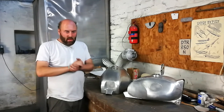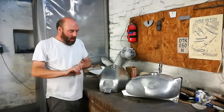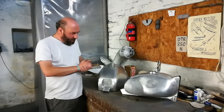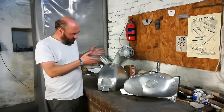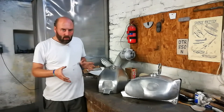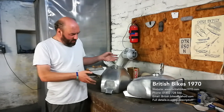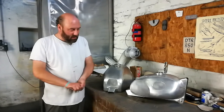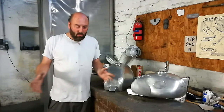Before we get to the grand finale of the Moto Guzzi tank build, we have got a few inquiries about what else we get up to, and there are a fair few bits and bobs. These, for example, are also aluminium fuel tanks — similar in some ways, but for a very different kind of motorcycle. These are tanks for Greaves, in this case the DD and the DCX. These have been made for Gary Bamford at British Bikes 1970, Greaves specialists. Now, the purpose here is to build these as new as we can — perfect replicas of the Greaves original tanks, but they, of course, were fiberglass, whereas these are aluminium. The reason for switching materials is the problems being encountered with modern fuels with the ethanol content.